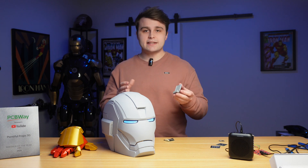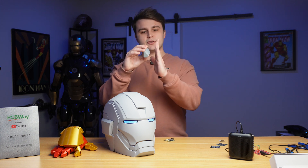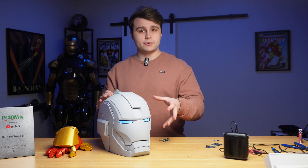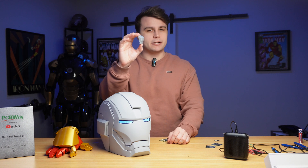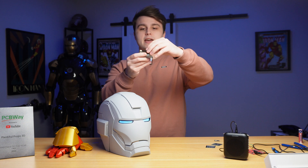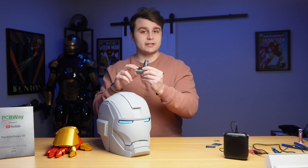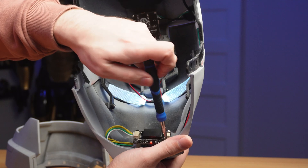Make sure the wires you're crimping match up with the correct pins. For the mount, similar to the one for the servo PCB, I'm leaving a link in the description to the negative version of this mount. You can import the 3D model into 3D Builder along with your helmet file, mesh them together, hit subtract while the helmet is selected, and it'll delete the excess rectangle so the mount perfectly aligns to the interior surfaces. Then put the PCB down into the mount, screw it down with machine screws, and screw the voice recognition module on top with M3 screws.